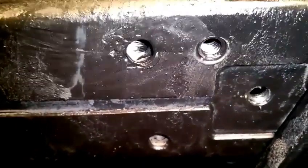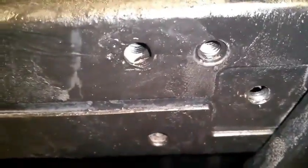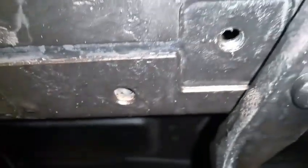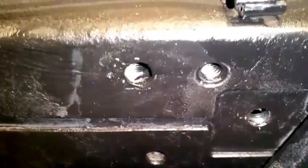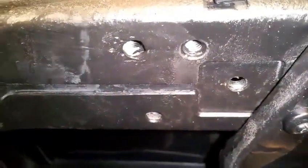With the others I adopted a different approach. I had some six millimeter plate that I cut into square washers, drilled a hole in each one, and welded a nut over the hole — so basically a nut on a square washer. Dropped them in, got them in position, bolted them from underneath, then welded around each square washer. That did the trick. I should have thought of that to start with, but they're all in there now and they're going nowhere.